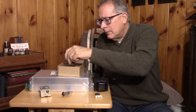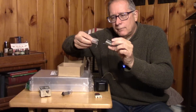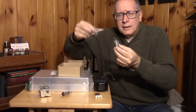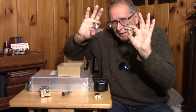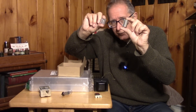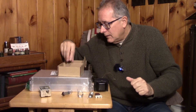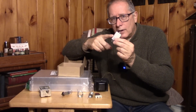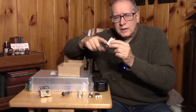The next reason you can't build the receiver: mini-ductor coils. It calls out for two of them — one for the front-end tuning preselector and one for the local oscillator tuning. These are getting hard to find, so we need to come up with a way to build the receiver without employing mini-ductors. That's reason number two we're going to take care of, along with the IF cans and anything needed when it comes to coils.